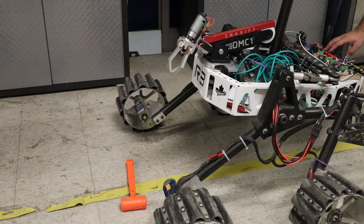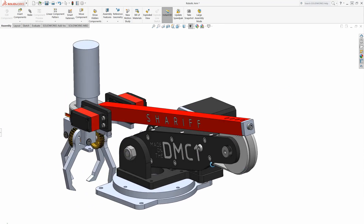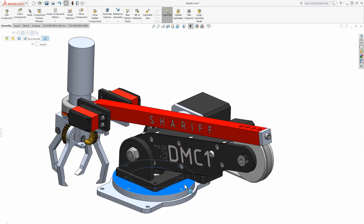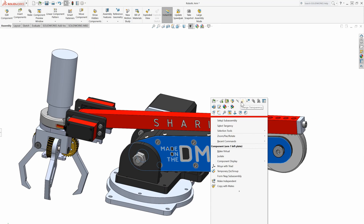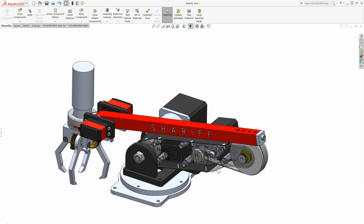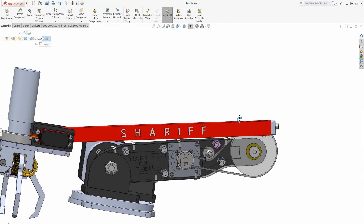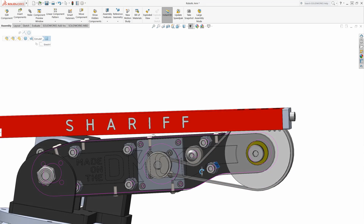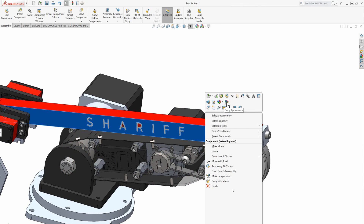So let's take a closer look at how the arm works. Looking at the arm CAD, we can see how it's all put together. Starting from the base, the shoulder joint is actually a turntable bearing off of Amazon, and that's the only sort of structural part that wasn't machined on the DMC1 CNC. The lower arm segment is two quarter inch thick plates, attached with standoffs, and it houses the tensioner for the upper arm segment. I have a separate video walking through exactly how this particular plate was made, so look out for that coming soon.